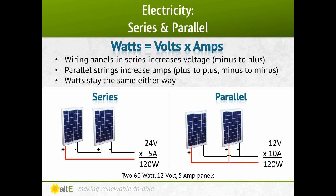Before we go further, I want to go over a quick reminder on wiring in series versus parallel. Wiring panels in series, where the negative of one is wired to the positive of the other, results in the current staying the same but the voltage increasing. Two panels wired in parallel, where the two positives are wired together and the two negatives are wired together, results in the voltage staying the same and the current increasing. It's important to note that regardless of the way it's wired, the power, or watts, remains the same.